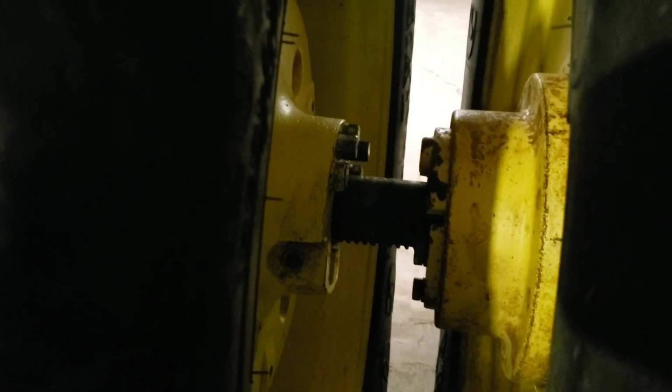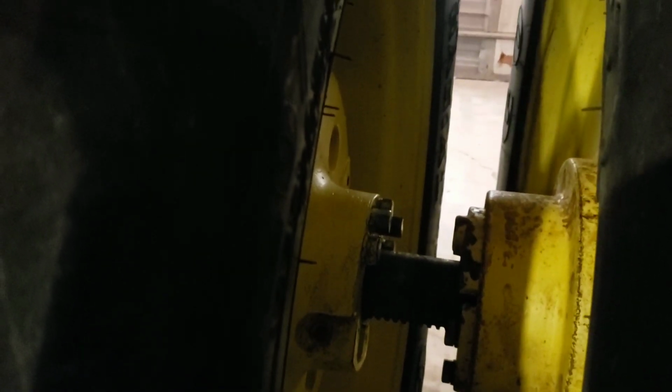Be careful when you're taking those off. Those wedges are heavy. They like to stick. Rust is your enemy with this. This tractor we're particularly looking at, I think at one time sprayed liquid in, which was a popular thing to do in the 1970s, and I believe that led to some of the corrosion. But the dual hub should be fairly easy to remove.